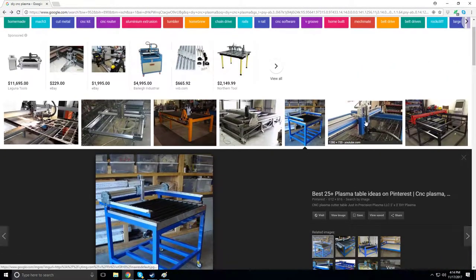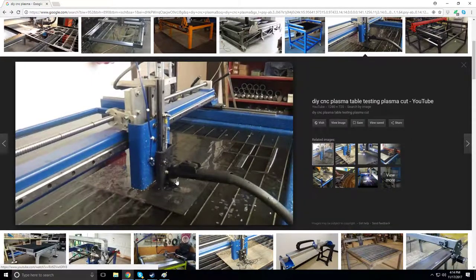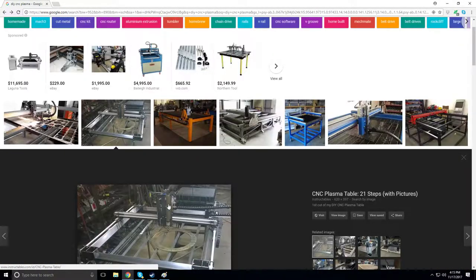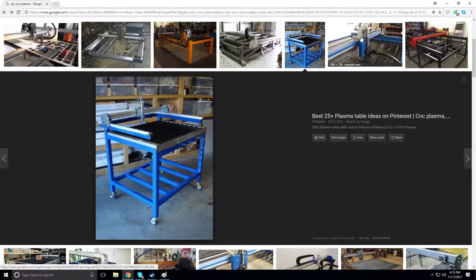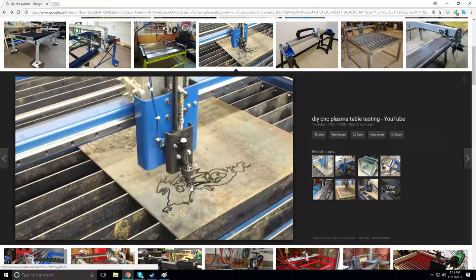The TechShop machine used drag chain as well. For the plasma cutter unit itself it's probably going to be a Cut 50 — a Chinese plasma cutter that can also be used for CNC. I'd like to get two torch attachments: one torch dedicated on the machine and another that I can pull off and use handheld, for cases where I get a bigger sheet of steel and want to cut it off the machine.